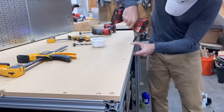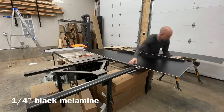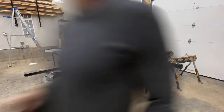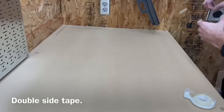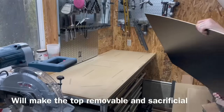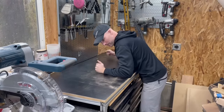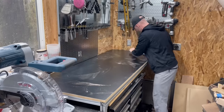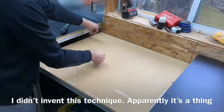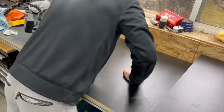One of the things I was most excited about for this workbench was having a sacrificial top — a top I could use and abuse and then replace a couple years down the road to make it look brand new. I called a local plywood and hardwood supplier and found black melamine, quarter-inch thick. They make it in different thicknesses and colors. I used double-sided tape to attach it, which I read about online. I'm still a little skeptical, but I've used that double-sided tape for a long time on inlays and it's very strong, so I think it will be fine.